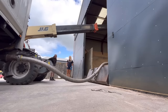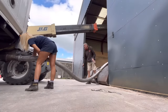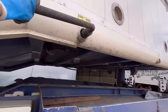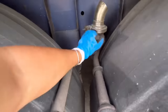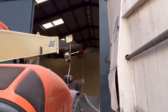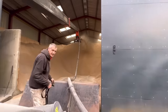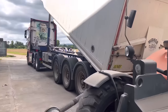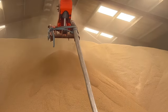We have a little discussion, and we decide to use my last remaining pipe, and push the handler further into the shed. This setup doesn't actually take too long at all, and then we can start blowing. So I open my internal doors and start the donkey engine up. I put the revs up, close the air valve, start the feeder, and then increase the air. I think you'll agree that this is a much better way of doing it. And then I tip the body up to about two rams. This is definitely a better way to make sure that all the product is going into the shed, and not drifting outside like it would with a normal tailboard tip. This will take about two hours to tip. Because I am not blowing into a bin, it's less likely to block up.